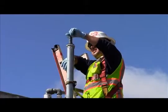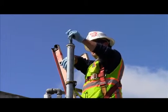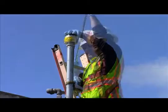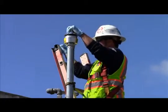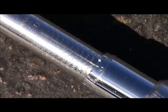After the tank tie test, the tester is now ready to reinstall the PV valves using pipe sealant or Teflon tape. The PV valves must be installed at the torque ranges specified in the applicable executive order. This particular PV valve was a Husky 5885 and has a torque setting of 20 to 50 foot-pounds. The tester, as you can see, has reinstalled the valve at a torque setting within the required range.